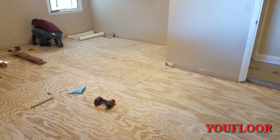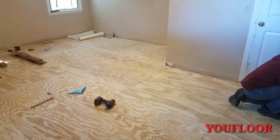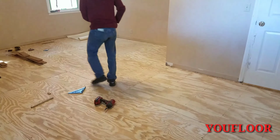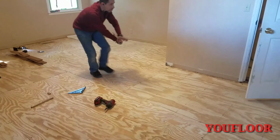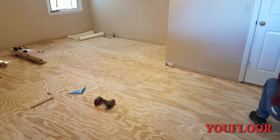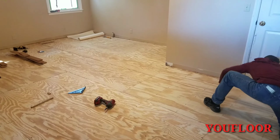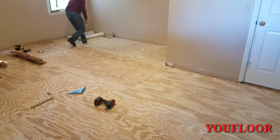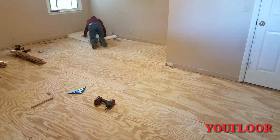So let's keep in mind, whenever I'm setting my first boards to go across the floor, instead of pulling 12 inches off of the face of them to my line, I will now be pulling 24 inches off of the face of them to my line to help keep my board straight all the way across. Of course, you guys just saw me do this, so basically I'm just putting 2 crow's feet, pulling a string across and snapping it just like we did before. Nothing new. Now that that's done, I can continue on with rolling out the paper.